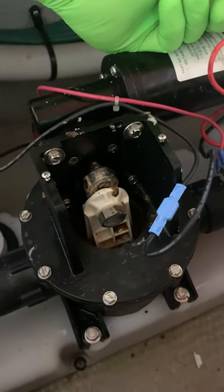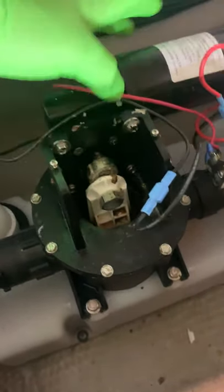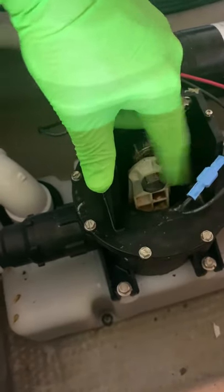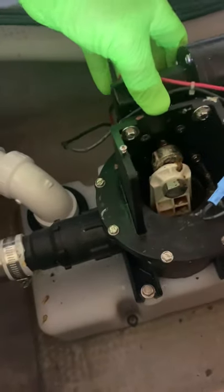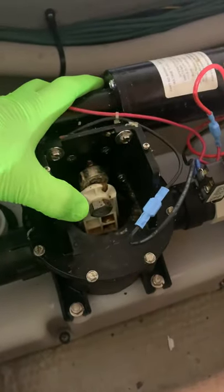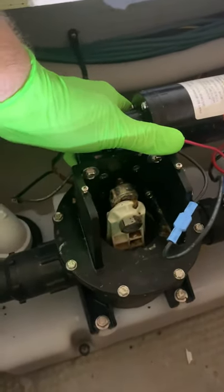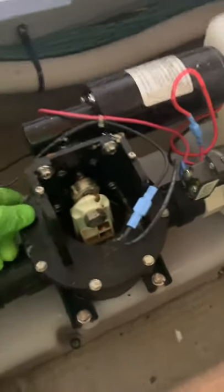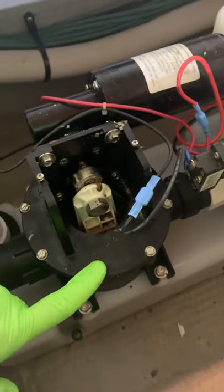So you've got to work on it — it's a bummer. You can pay people to do it but you are going to bleed out the nose. So what we're going to do is get the pump off first. There are four screws, and then this thing will slide off to the back after you release the axle bolt that goes into the cam. You really don't want to torque down on it too hard because this is just fiber-reinforced plastic, and with time and age it gets brittle. A good word of advice I got from others: only use hand tools. As much as you might want to put your screw gun on here — bad idea. Do it by hand. You'll be happy if you don't crack the plastic, because if you have to buy the whole assembly your repair costs are going to jump up about $600.